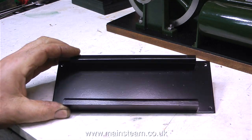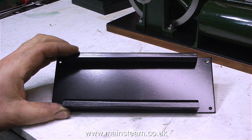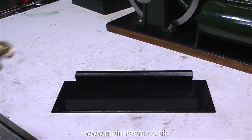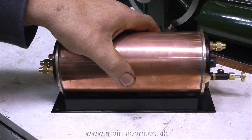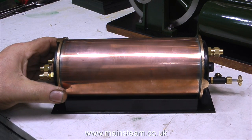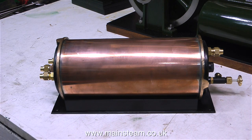The day after, when the edge primer was fully cured, I painted it with black paint. In the same way I painted the underside first, then once again using my special support with the four panel pins I was able to turn the part over and spray the top. This whole piece of plywood with four panel pins sticking out of the top is a very useful thing to have in the workshop.